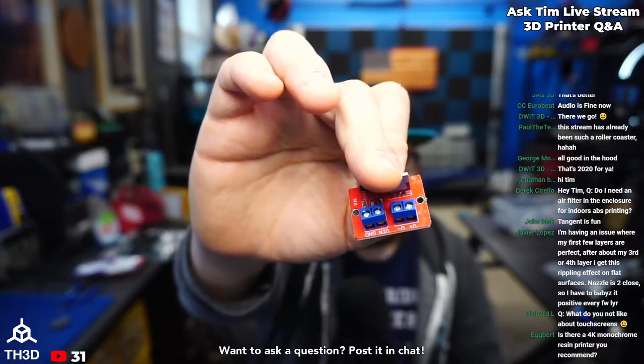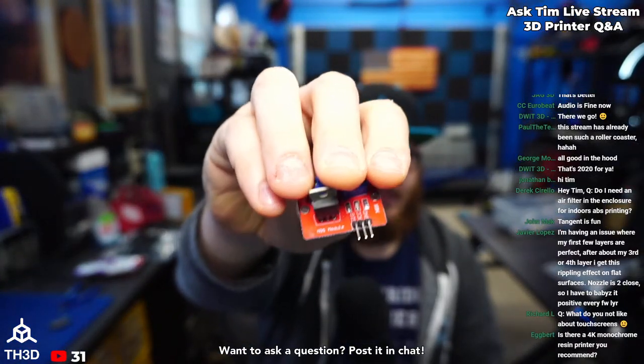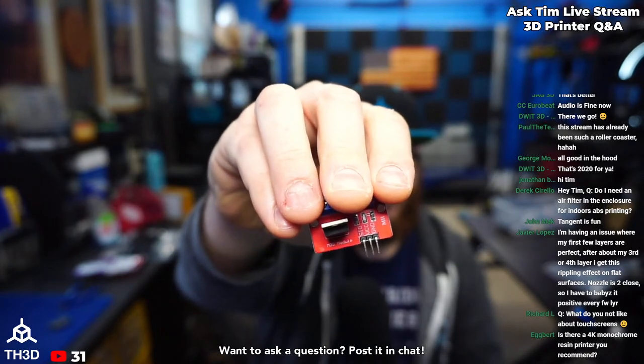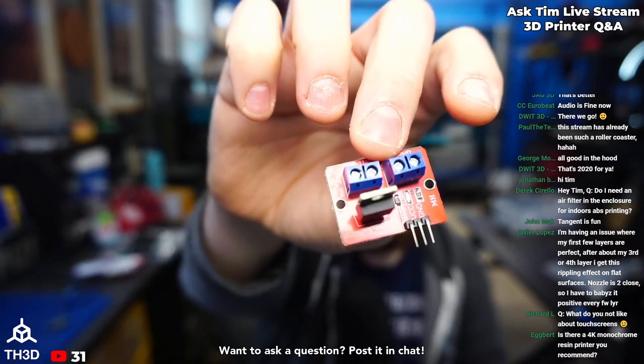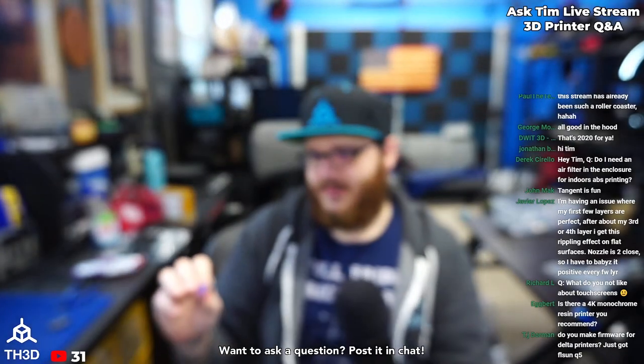I know you guys know I'm into home automation stuff. But these will be on the shop. They're very simple. They have power in, power out, and then they connect to your control board on a spare IO pin. So you have the SIG, VCC, and ground. As you can see there, SIG is for signal, VCC and ground. And basically, if the signal pin is high or low, meaning no voltage or 3.3 to 5 volts, depends on if it lets electricity flow.